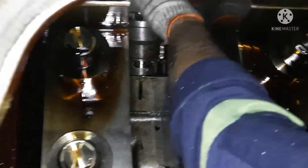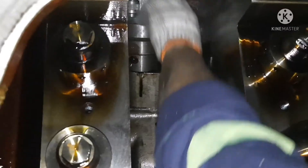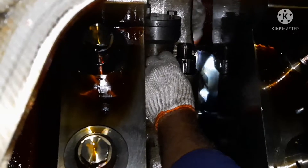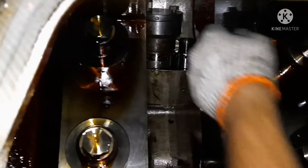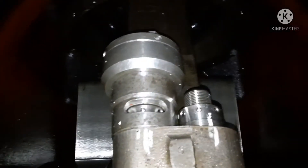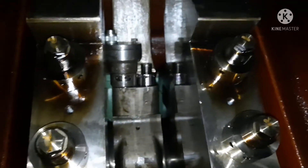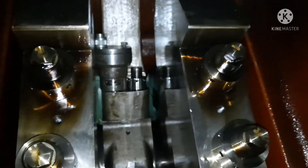Be careful when using the jack inside the crankcase because there are chances for the jack to slip if you don't hold it properly. Align the stand with the hole facing towards you so that it will be easy to handle the Tommy bar for opening or closing the nut. Once the hydraulic jack is in place, fix the hose.